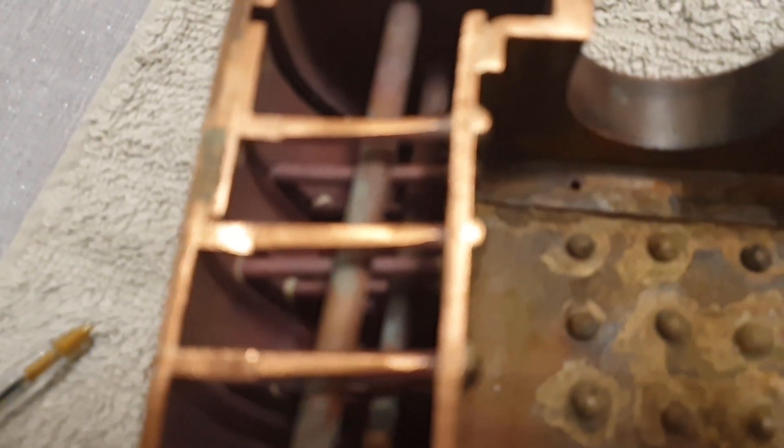You can see down there the silver solder having flowed right through the copper plate - it's shining there on that rivet. You can see the ring on this rivet here, and on the lower of it again we can see the silver solder ring where it's flowed through the plate, because it would have been applied from the outside into the countersunk hole and it's gone right through the thickness of this copper plate, showing on the inside of the boiler as a fillet. And that proves a good joint - that's what we're aiming for.